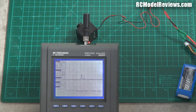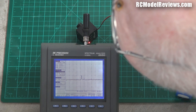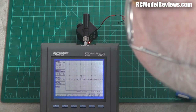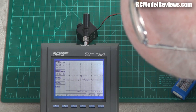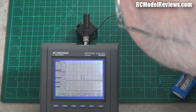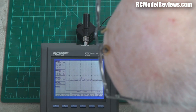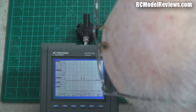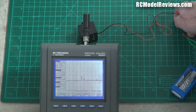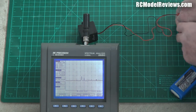I must say I'm quite impressed with that. Let me just make sure we've got maximum sensitivity — yes, it's at maximum sensitivity. I'll just disconnect the power so you can see: there's only a very small increase in the noise floor. I'll move my marker down to 433 MHz. The noise level at the marker is minus 112 dB — that's the background noise. So let's plug the BossCam back in and turn it on. It now says minus 111 dB, so there's not a lot of increase. This is not a very noisy camera from a UHF perspective. That's excellent.